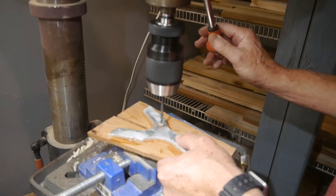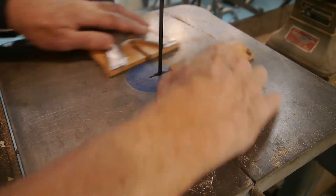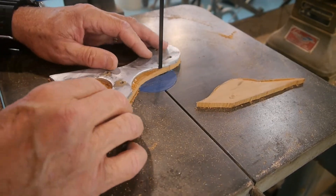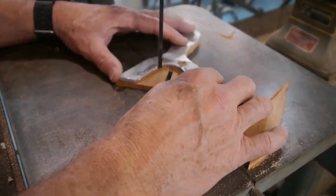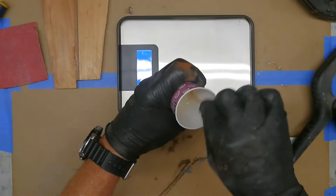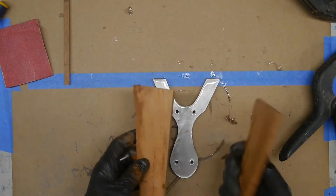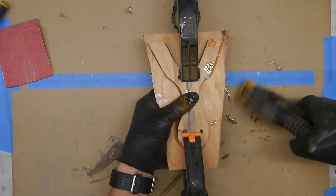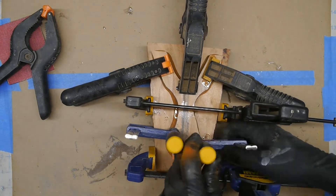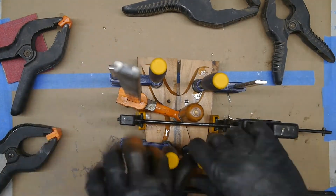At this point I'm taking the drill and re-drilling through the same holes as before, which are now full of epoxy. I'm drilling out the epoxy and also drilling into the wood because I'm going to laminate pieces on the top and need to find the holes from the bottom. Then I'll cut this out fairly roughly — the final cutting will go after I glue on the other side. Another round of epoxy for the other side. I always wear gloves with epoxy because I get it everywhere — I've ruined just about every pair of pants I have.